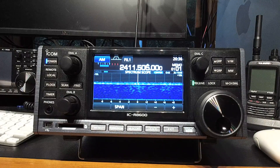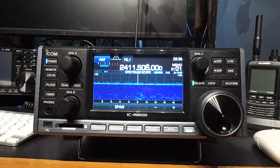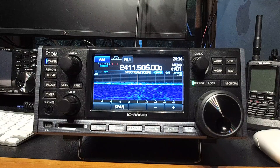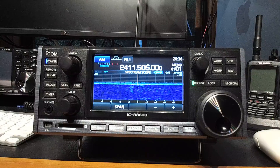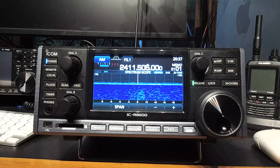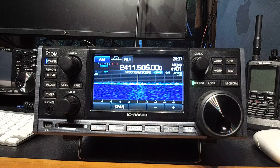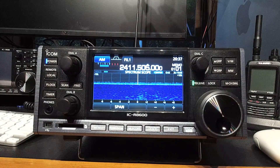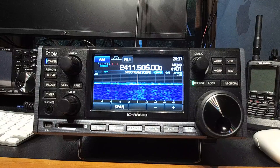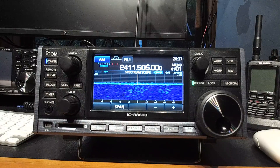The interesting thing is that each of those carriers is encoding data into what are called symbols. The way it's doing that is by using a technology called quadrature amplitude modulation. Basically that's a fancy way of saying it's varying the phase and the amplitude of each carrier over one period. When we talk about things like Yaesu System Fusion — we call it C4FM — we're talking about four carriers. Wi-Fi isn't just using four carriers, it's using heaps and heaps. I was trying to think of the exact number — it eludes me — but lots and lots, as you've seen on the scope.